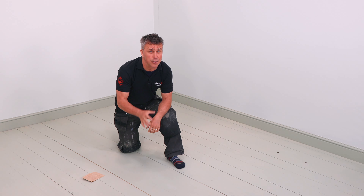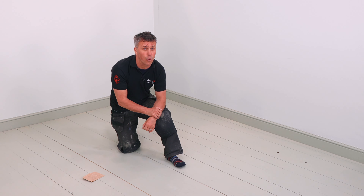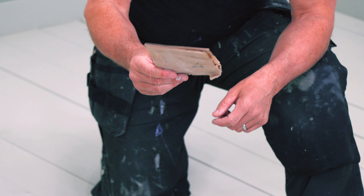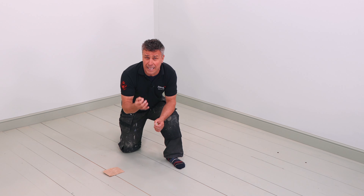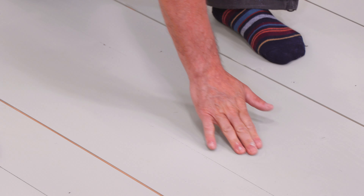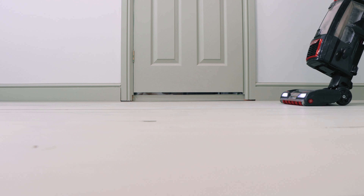I'm almost ready to apply my second coat on the floor. I've left this to dry overnight; however, the minimum drying time is about four hours, but you must take your shoes off when working on the surface. I'm going to give the surface a gentle sand down with a P150 grade. The reason for this is because the first coat I applied onto the bare wood was diluted, so it was a little bit thinner — it penetrates into the wood and anchors onto it, which is exactly what we want. However, it might leave the surface, certainly where the knots are, a little bit more coarse and rough. So I give it a light sanding, then vacuum the floor, wipe it down and it's ready for the second coat.